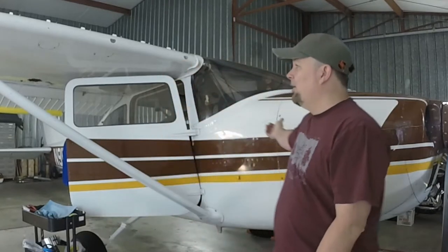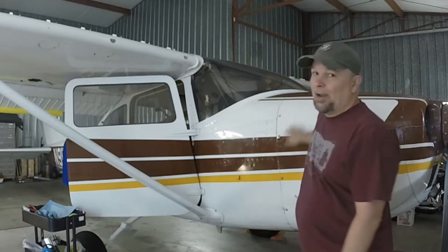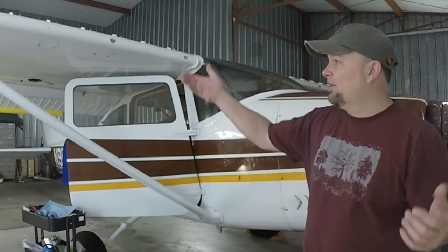We've had issues with Daisy and her flaps. Before the last annual, I noticed I was having some wag out of the flaps - what we mean by wag is they kind of hunt, search up and down when selected for takeoff. Came to find out the switches were bad; one actually cracked in half. I'll find pictures of them somewhere. So we got the switches replaced.